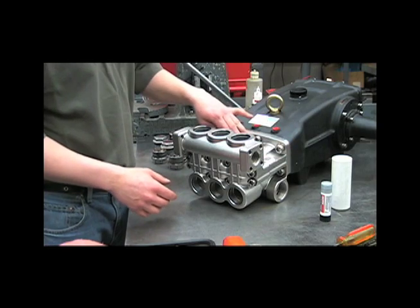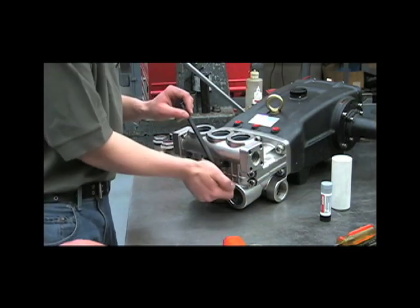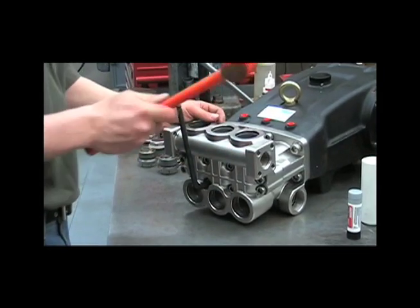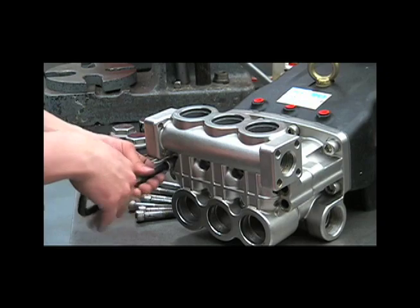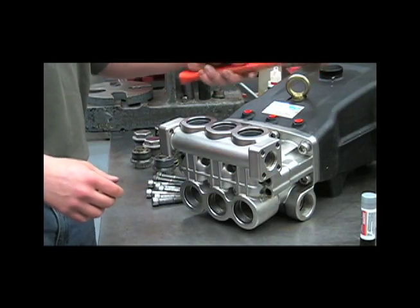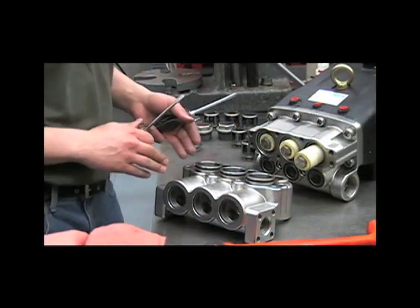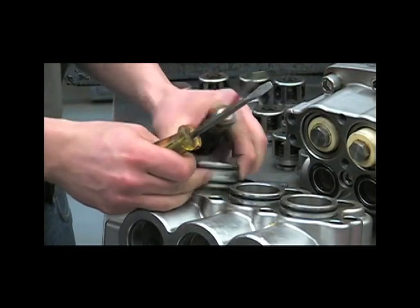You'll need to look at the packings if there is a water leak between the inlet manifold and discharge manifold. To remove the discharge manifold, we will use an Allen wrench and a rubber hammer to take these out. Remove the discharge manifold, then remove the spacers by gently prying up on them with two screwdrivers in the bottom ridge, and check the O-rings for any damage.